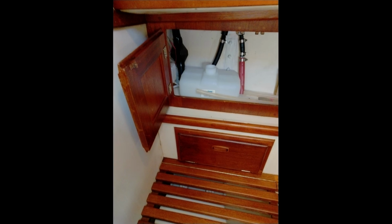One more big item now to take care of: where to put the heater's supply tank. I'll go with a gravity feed from the tank to the stove to keep things simple. I don't want to give up more cabin space in the area where the heater is for a tank, so I'll choose the cabinet behind the head, on the other side of the bulkhead from the stove. If I get spills, I'd rather have it in the head than out here in the cabin.